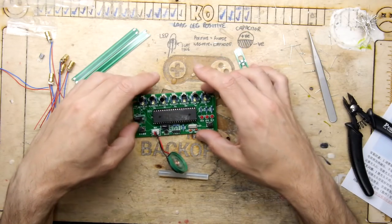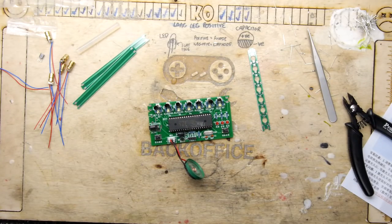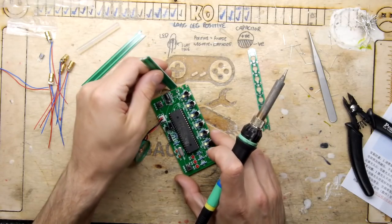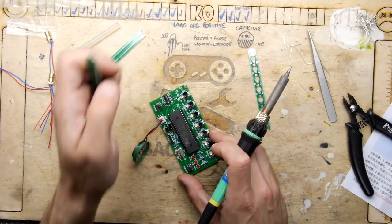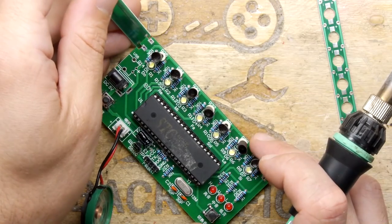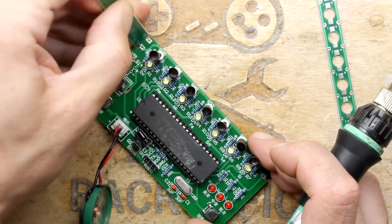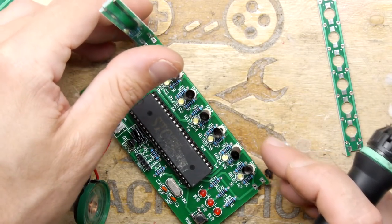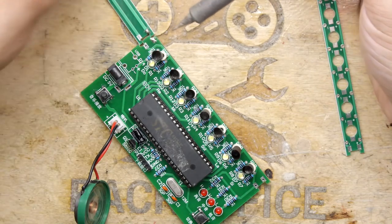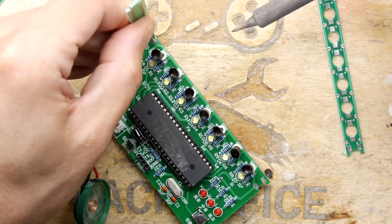So we've got to assemble this little bridging device here. It's got some sort of tags. They're just solder tags, effectively. So we're soldering this into place. Pop that. Let's see, they seem to be double-sided, so it doesn't matter which way around they go. Too tight. Perfecto. Just going to tin it. Tin both, actually. I don't have enough hands, so we need to tin both. Just like that.